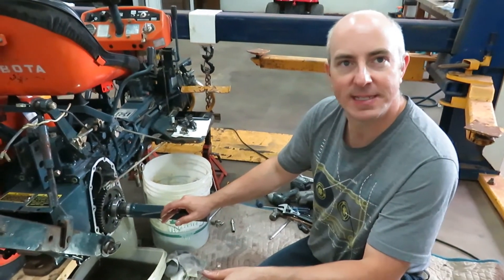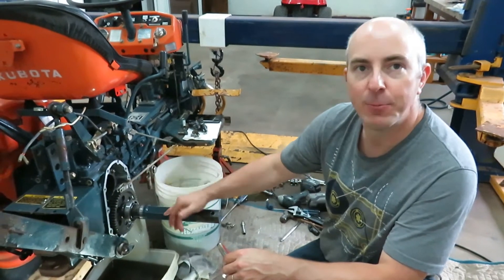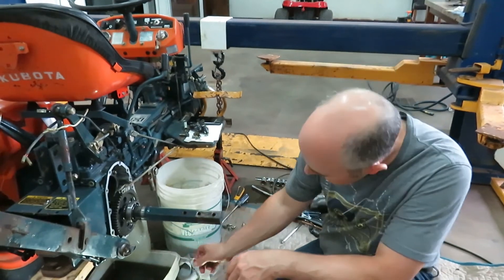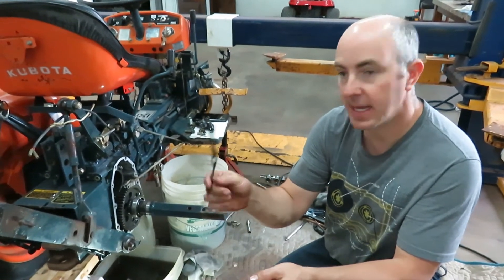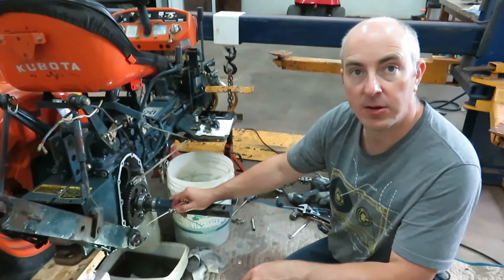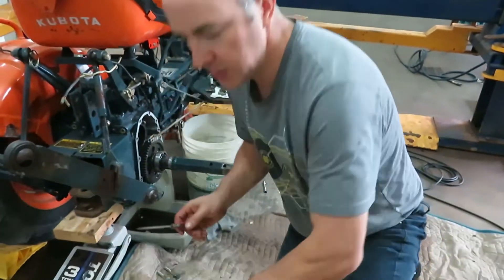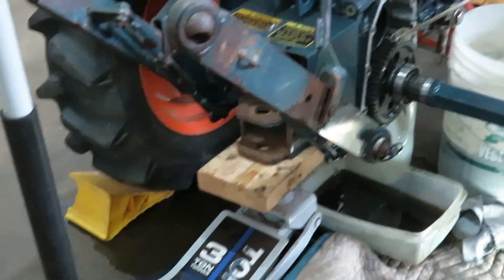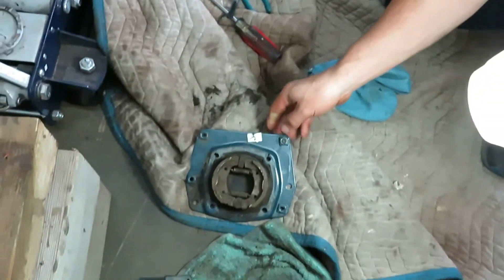Now you've seen what's involved with removing a portion of the transmission side on this tractor. The next step is I'm going to take some brake clean and clean off this surface. It looks like the majority of the gasket came off as we were taking off the side cover, but I'll prepare this surface for the re-installation of the housing. I'll come over here too, remove the gasket on this surface, get that cleaned off, and also spend some time cleaning up the brake. So I'll get all my parts cleaned up ready for re-installation, and in the next video you'll see the whole re-installation of the tractor. Hopefully you found this useful — stay tuned to the next one when we get this tractor rebuilt. Take care.